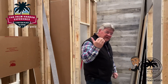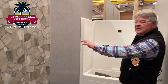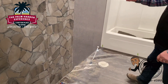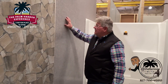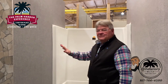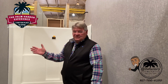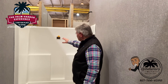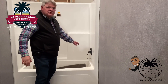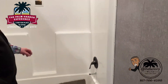Let's show you what a bathroom looks like — come follow me. Here we walk into one of the bathrooms. We've already got the decorative panels put up that go behind the lavatories and the double lavatories. The sink and commode have been plumbed in with shutoff valves. These panels in a wet area are vinyl — run your nail over them and you can see it's vinyl, so anything that gets on there can be easily cleaned. That's on half-inch gypsum, which is far better than builder grade. Builder grade is three-eighths inch and HUD will approve three-eighths, but we use half-inch. Already set into this home is the one-piece fiberglass tub — no seams — and the faucets are already mounted in, because as we showed on previous videos, these are all sub-assemblies done offline and then put into the one-piece fiberglass tub.